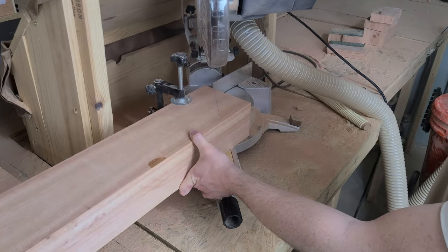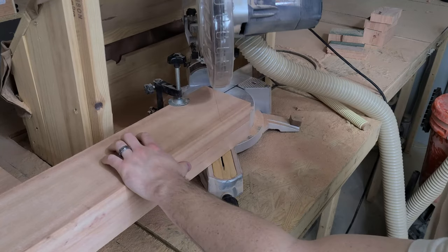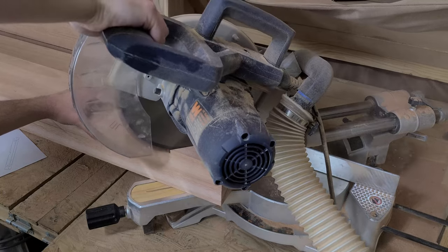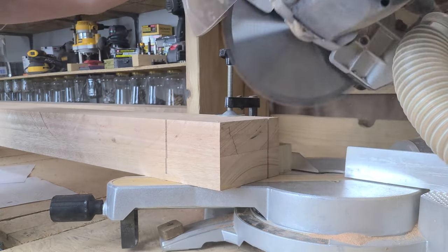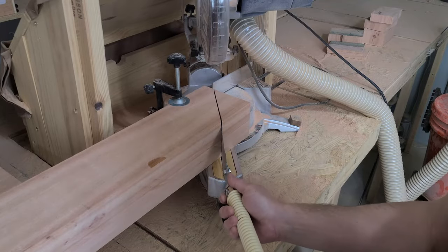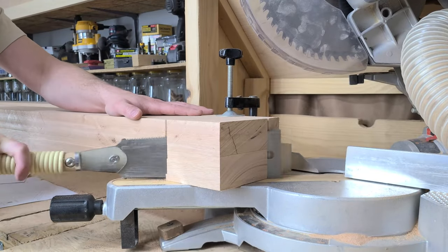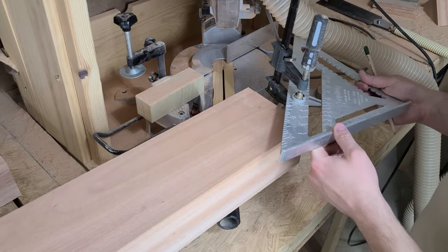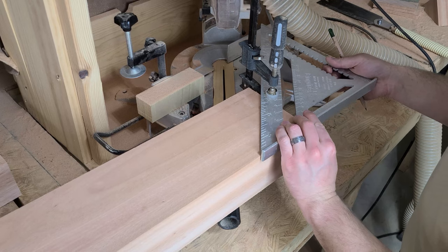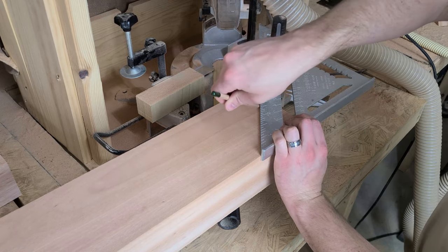This saw didn't come with a laser line, but we added one to it using a disc that goes between the blade and the arbor nut — we'll leave a link below in case anyone else needs one. They make things so much easier. Since these boards are so thick and wide, the blade can't quite make it through the front edge of the board, so it's time to break out the pull saw again. There is only a small amount of material left, so this goes pretty quickly. Now we can flip the board around to mark the other side, and with the speed square set up, this takes seconds and we're ready to cut. We just repeat the process to cut the other corners.